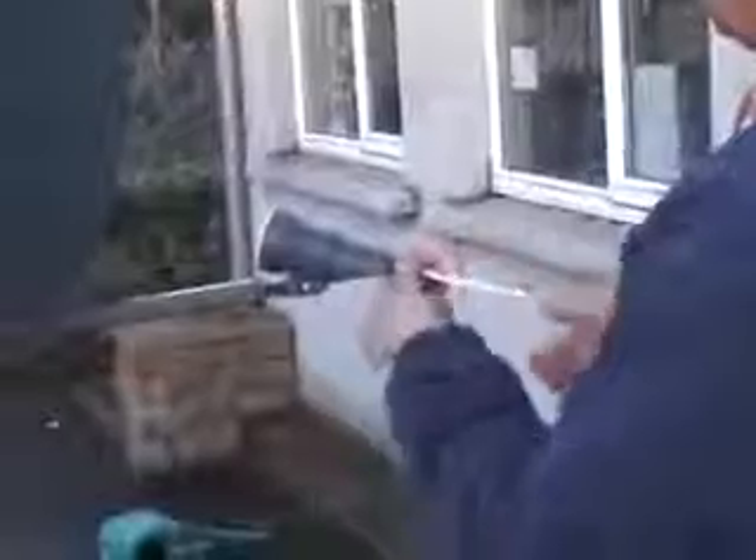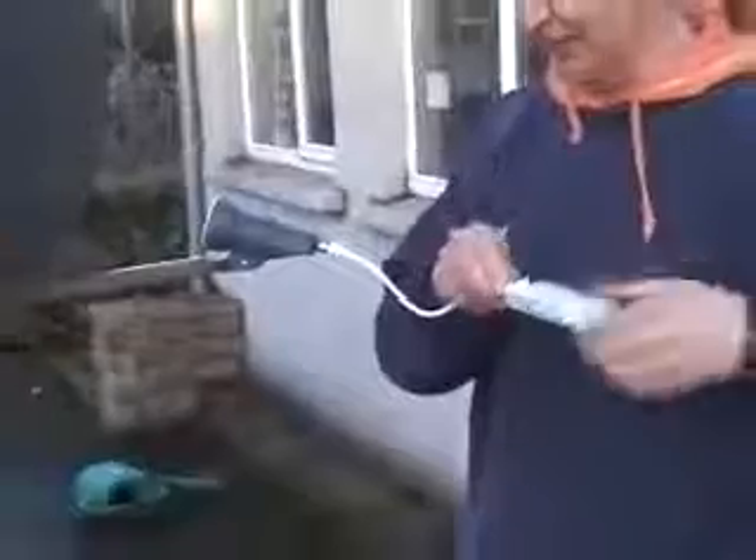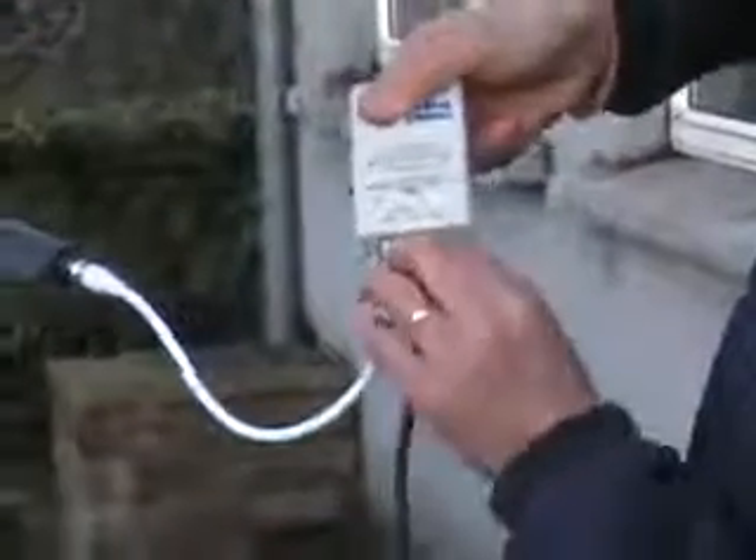I'll now demonstrate how we'd use it with a satellite dish. Here we have a small satellite cable that comes with the kit — it screws onto the LNB. The idea is that we put the satellite meter in between the satellite receiver and the satellite dish. We don't need the meter turned on for this; the input marked 'Satellite LNB' is where we screw this in.